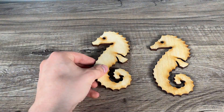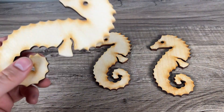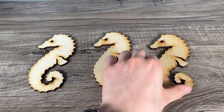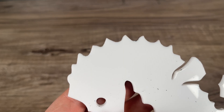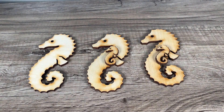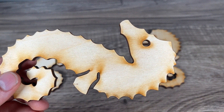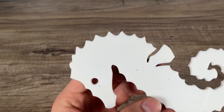Finally, let's talk about surface quality. As we move to lenses with larger focal distances, we're dealing with larger beam sizes, which means the power isn't distributed evenly across the cut. Most of it is still concentrated towards the center, leading to a slight outline around the edges on plywood, and some glue residue on the protective paper film on acrylic. With the 101.6mm lens, the outline on plywood is quite subtle, and you probably wouldn't notice it unless you were specifically looking for it. And on the quarter-inch acrylic, there is some residue left, but it's fairly minimal.